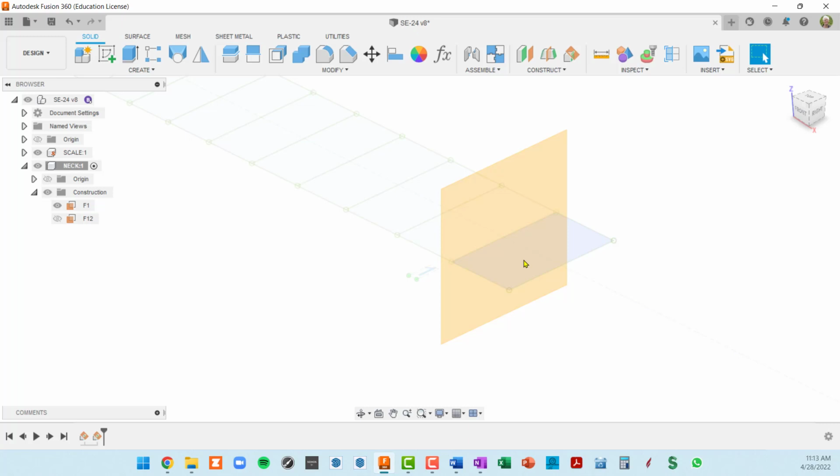Now I have three different sources of information to do this profile. I have purchased a PRS printed plan which has a fret 1 and fret 12 profile, but it doesn't seem to be too precise. I also got a profile off the PRS website, which uses their thin profile. I think they call it pattern thin. And lastly, I have a PRS guitar, so I measured the neck, and I got the width at fret 1 and the height at fret 1, and then I subtracted the height of the fretboard, which I'm assuming is a 1/4 inch in its tallest position.